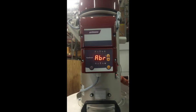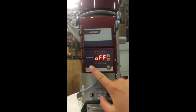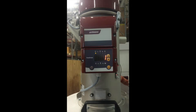Three important errors to know are errors 1, 3, and 9. Error 1 indicates a general cycle error dealing with the time allotted to convey the material. Error 3 shows that no material is being conveyed — this is adjusted within code 120 using parameters C3 and C10. If error 9 pops up, it signals that your motor has reached 900 operational hours, indicating that the motor brushes will need to be checked and possibly replaced.